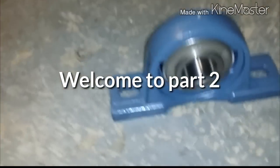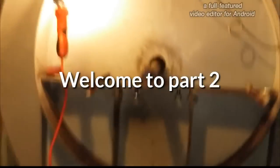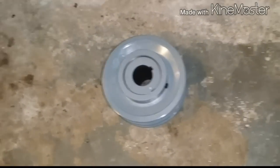So HVAC brothers, like I said, I got the new bearing. This guy's gonna go right on that shaft. And then I got a new pulley, the 2VP50, 4.5 inch, going on that motor right there. It was installed yesterday, wired and everything. The old one is here, so that sucker's staying here. I'm not carrying it up.